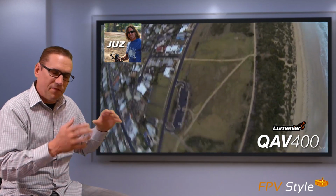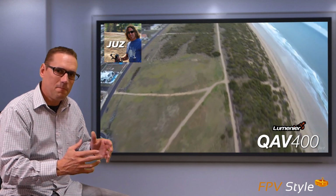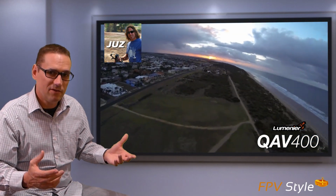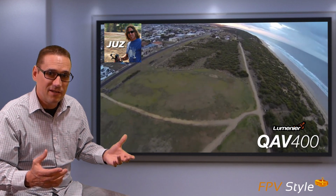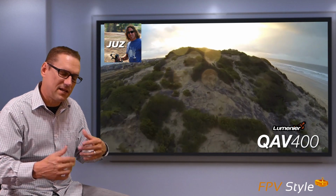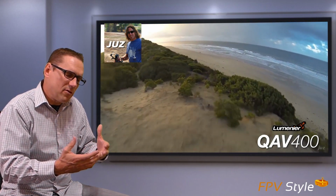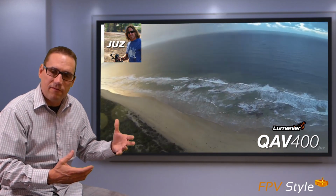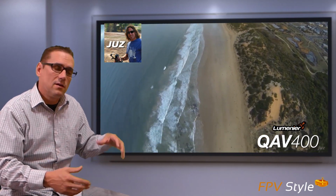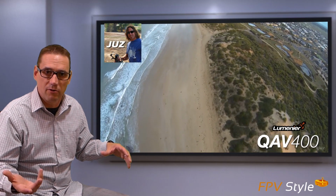So, you would think, wow, small, agile, stunt flying, but would it be any good at anything else? The answer? Yes. I don't know what it is about the frame design. I think it might be a little bit of added weight. We said it's light. Yes, it's light for your average quadcopter, but it's not really all that light when you compare it to something like the Blade 350 or the DJI Phantom. It's heavier. It's 375 grams, the frame alone. And those platforms are certainly lighter than that. I mean, a Flame Wheel 450 I think is like 282 grams, something like that.